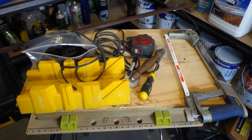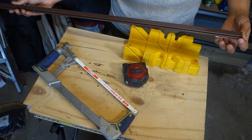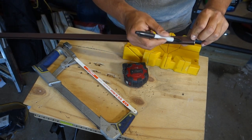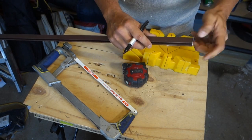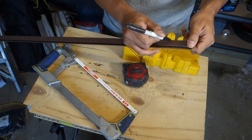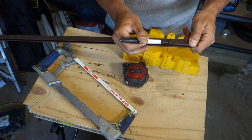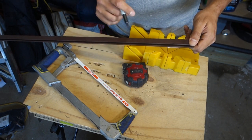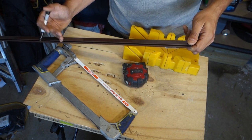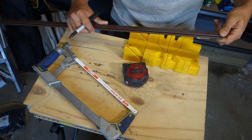Now that we've got that quick overview out of the way, let's get straight into it step by step. Our measurements are 390mm wide and 980mm in height. The first thing to note is that little ridge — it always has to be on the inside of the frame. Anytime we make our cut it's always going to be coming down on a 45-degree angle with the shorter side being the ridge side. Before we measure our first piece I'm going to cut this end section off so I can measure from tip to the other end.